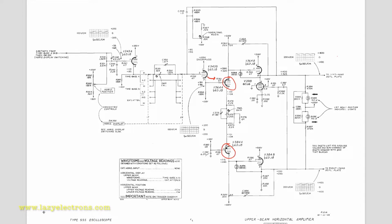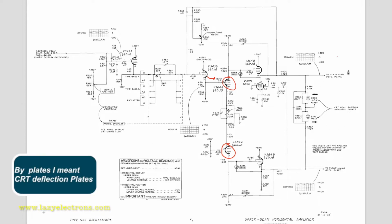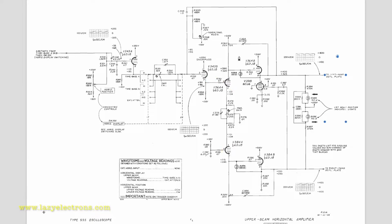If you wonder why the paraphase amplifier or differential signals are used all throughout the horizontal and vertical sections, the main reason is that the plates are always driven with a differential signal. The paraphase amplifier then provides the output to the next stage, which is the final driver amplifier, or what you call the cathode follower, and that is connected to the plates sitting right down here. This is the deflection plate, I would call it. And that's the signal. It's already marked here.